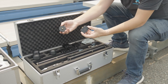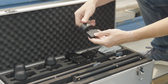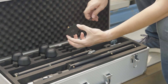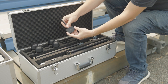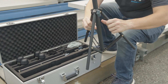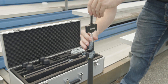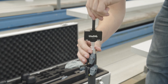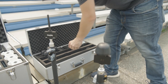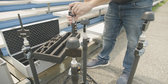Simply screw the dome antennas to the repeaters labeled A0, A1, A2, and A3. The control repeater, labeled C0, gets a standard antenna. Next, open the adjustable stands by tripoding the legs and raising the stand using the knobs. Attach the repeaters to the 3/8 screw attachment on top. We'll fast forward here as we build the stands — please note that there are more stands under the foam block. Finish by extending all stands to their maximum height.